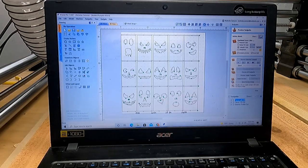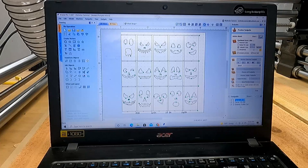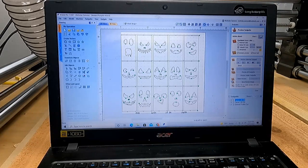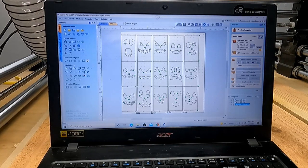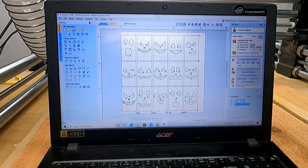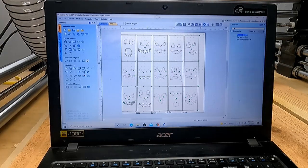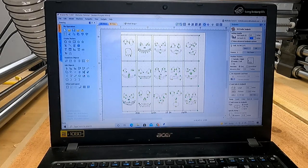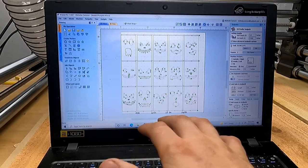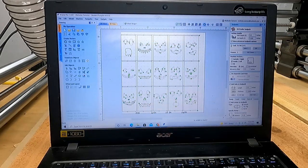So, did all that. I have the quarter inch bit in first, so I'm gonna do the exterior profile cut first, then the faces, with the quarter inch end mill. Profile cut, I typically go with first because if I'm gonna hit those screws, I need to find out now, before I cut the faces and have to do a bunch of weird stuff to make it work. The faces is probably the most interesting one, so we'll just start with that one. Right here, it matches the material thickness. You can also put in Z equals, and it updates it to be the Z number that we just put in from our material.